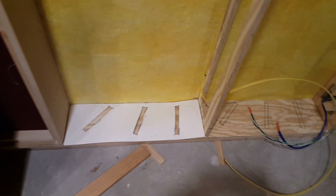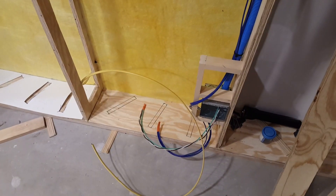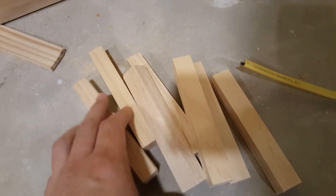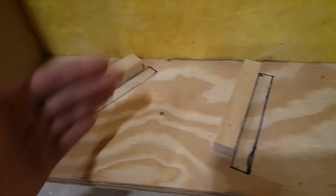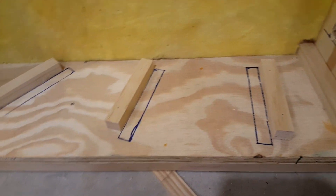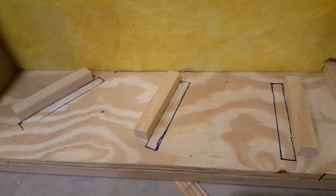These are not at all structural — they just kind of hang in there, so they don't have to be fastened in any extreme way. I've cut these supports maybe 5½ inches and put them on the outside line from the template I drew, just nailed them in place with brad nails. The waveguides will push against here, and then I can nail into them just to keep them in place. The waveguides are not structural, so it doesn't need to be anything beefy — it just has to keep them in place.